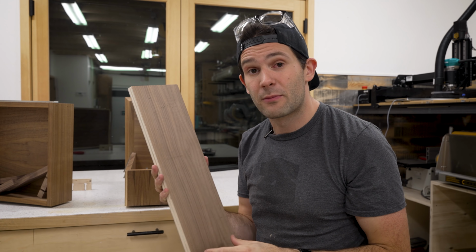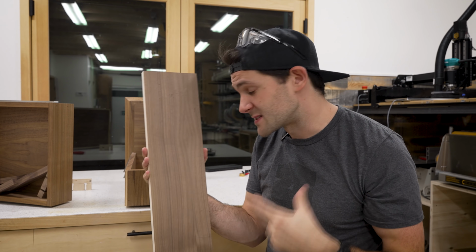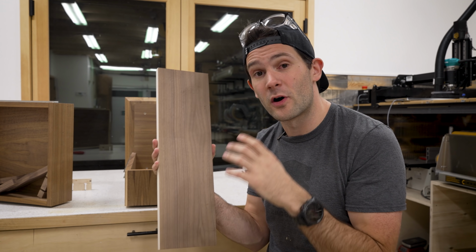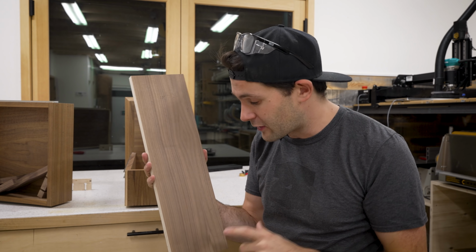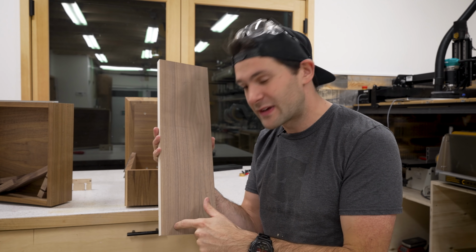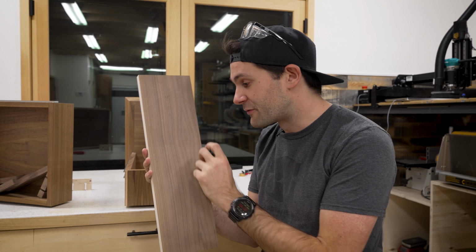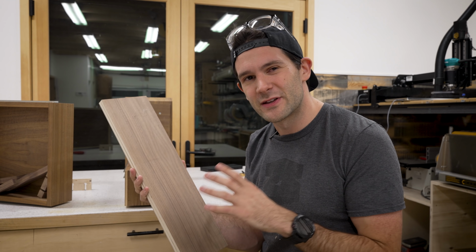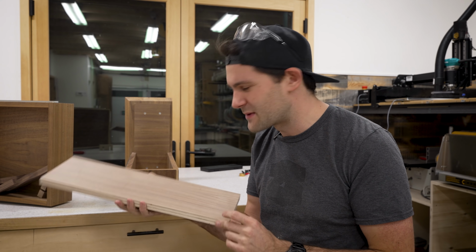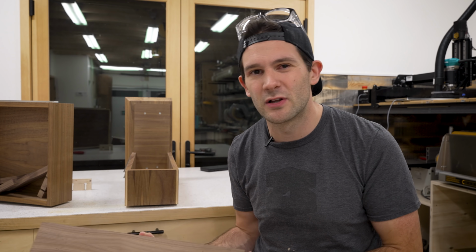And this carve is going to be a little bit more intricate and we're going to have to do it in two passes. The first one is just going to be cutting out all the circular holes for the lenses to slot into. Then we're going to have to change the router head, come back and do an engraving layer that's going to engrave all the focal lengths. I'm not quite sure how that's going to go, swapping the heads and getting all the different carves to happen at the right time. So it's going to be interesting, but I'm starting to feel a little bit more confident.